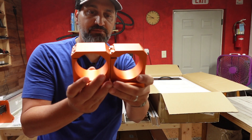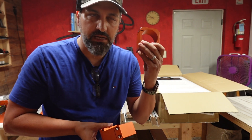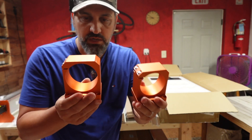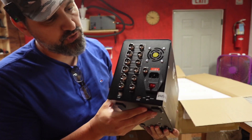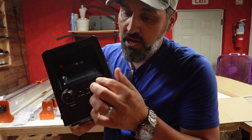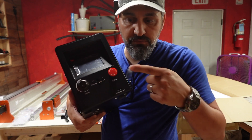There's a 69mm and a 65mm bracket for adapting a different kind of spindle — so if you have a Makita router, a Bauer router, a DeWalt, or anything like that, you can use one of these. Last is the controller box right here — everything is labeled and super easy to read. Don't forget: when you get your machine for the very first time, your E-stop is probably going to be pushed in. If you can't figure out why your machine isn't working, make sure you flip that switch.